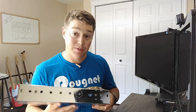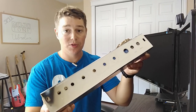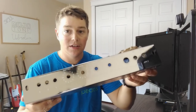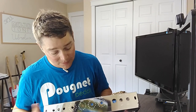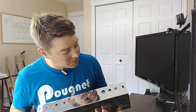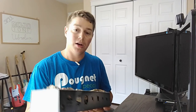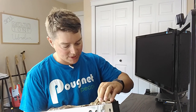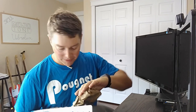I haven't found the board just yet. Next I'm going to look inside this enclosure because there seems to be a lot of stuff in here. This is also something I purchased from Mojotone — this is where all the amplifier circuitry is going to reside once it's fully completed. We've got the three inputs on the Tweed Vibrolux, and all the screen-printed logos for depth, speed for the tremolo, and then tone and volume. We've got our spot for the fuse and where the on-off switch is going to reside. On the bottom, there are holes for our vacuum tubes. Looking inside — I can see there's lots of cloth wire in there and my vacuum tubes as well. Let's just pull it out.